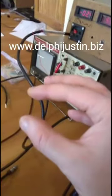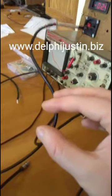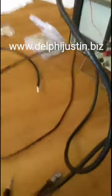So for a 10 meg ohm one, you'll have to have a 50 meg ohm on top and a 12.5 meg ohm on the bottom. The 50 meg ohm one, I found out they don't make it. It's very rare to find, it's expensive, and also it's pretty big. It's probably going to be about that big, and that tall. Just think about fitting that in your pen. You wouldn't be able to fit that in at all.